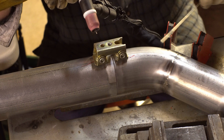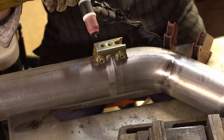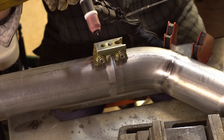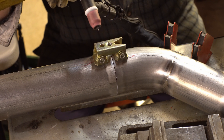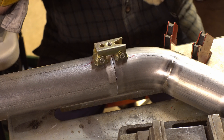I keep a short piece of stainless 309 filler rod handy just in case I have a hard time tacking or getting the sides to flow together. The cool thing about this is once you start welding and get it flowing, unlike aluminum, steel just kind of zippers shut — you can actually see it happen. It gives you really nice welds.